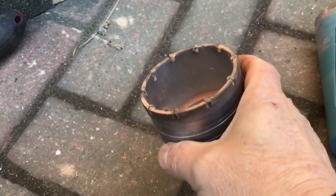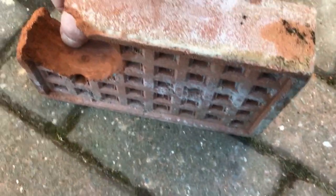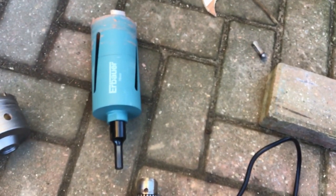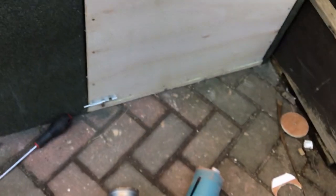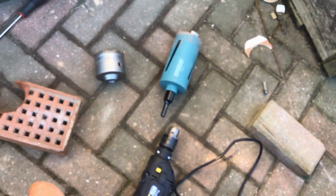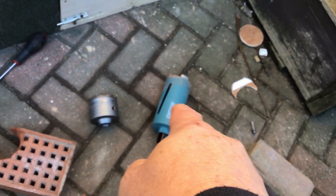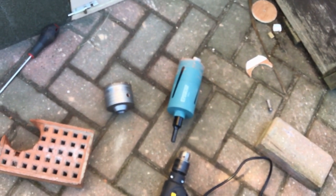When I started doing that I only had one tungsten carbide bit - what a pile of rubbish. Three quarters of an hour working my way through it, I got just over halfway using that, and I had to push it that hard that I pushed the air brick out. So this morning I went and bought the diamond one. The diamond one did both holes in maybe ten minutes. So whatever you do, if you're drilling through air bricks, do not cheap out - buy the diamond bit because you will regret it. I ended up getting it from B&Q.